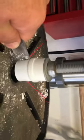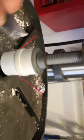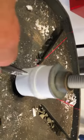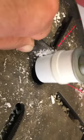You want what they call a negative rake — you don't want to be cutting into it aggressively or it'll kick back on you and hurt you if you're not careful. Keep it slightly negative, and you can just sit here and scrape the diameter off of this thing. It's that easy, and you can even make a taper. Just be sure to stop and measure it every once in a while.